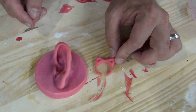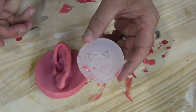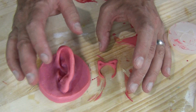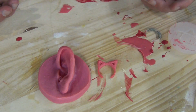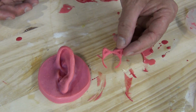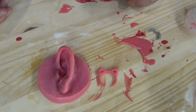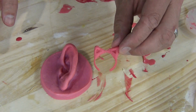She's happy. Good. Now, a quick word of safety about all the products we use. Platinum silicone is incredibly safe to work with, so we don't really have any issue there. But I would never leave my children alone to mix resins that turn solid, mainly because if they were to spill that, it would destroy whatever is around them. But also there are safety issues: I would want them mixing in a well-ventilated area, wearing gloves, and all of that. So it's a good idea if you're doing a project like this for you to do the mixing and measuring and pouring and not involve your children in the resin aspect of the process, just like you wouldn't let your child change the oil on your car. So there you have the basic process of making a mold and a cast of a little resin costume accessory for a doll.